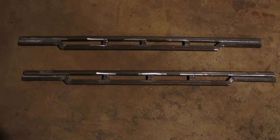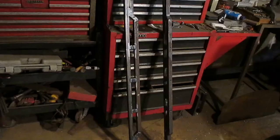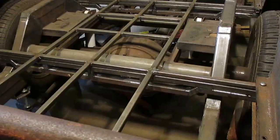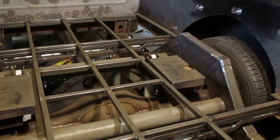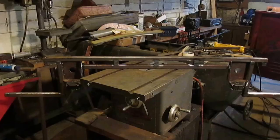There are my two center bed supports — I have to weld them all up and maybe do a little bit of grinding here and there for better fit, but they should be nice and strong. I drilled some holes in the bottom of that one to vent it so it doesn't rust from the inside out, and I'm ready to put them in. The bed support is installed and you can see I got the other one up there too. There's not a lot of room over there by the frame but there's probably a good inch up there. In the front there's quite a bit and I'm gonna shove another piece of one-by-one square tube eighth-inch wall underneath that front support.